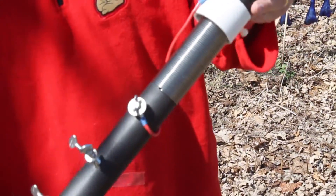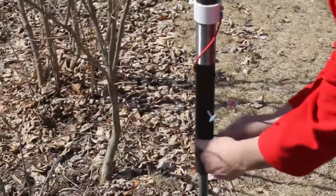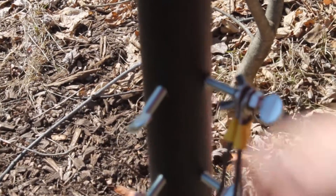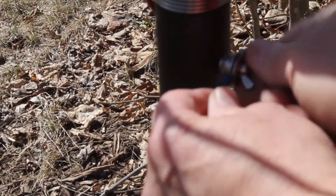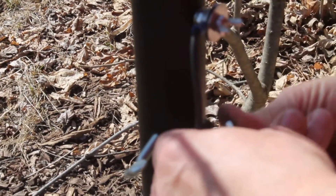This is the tuning part of the antenna, and this is the part that goes onto a base. I'll tighten down a couple of these just to make them a little snug for now. I have three 40-foot radials here, and I'll tighten this one down so it goes against that post. Here is the coax that we're going to use. The top one goes here, which is the driven element, and this is the ground part, which is the braid of that antenna.